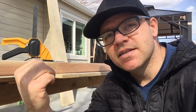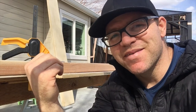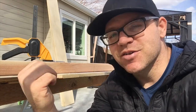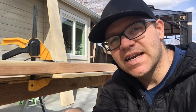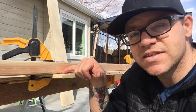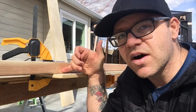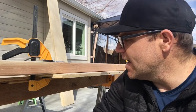As you saw me cut that, I set up a two-by-four on here to guide my saw. You can actually get metal guides at Home Depot or places like that, but I didn't pick one up, so I just used what I already had. All it takes is the clamps and the two-by-four mounted on there. Even though it shifted over a little bit on me, the edge of my saw was still along the guide so it still got me a clean, straight cut. It's a quick fix if you don't have a guide already.